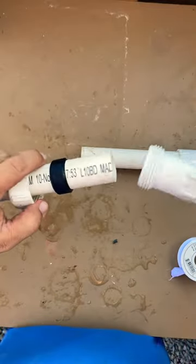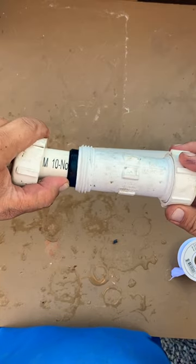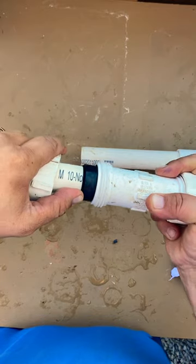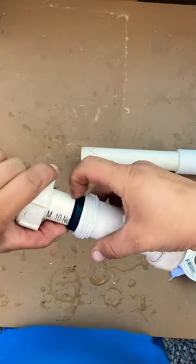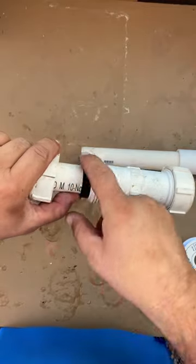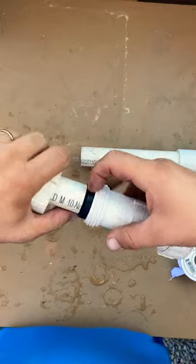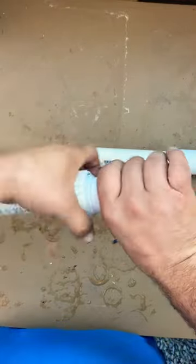This is just an example — I'm not actually attaching to the pipe. You can see how it slides down in there. If it's on a bind and won't force in, it's going to leak no matter how much you tighten it. You'll have to force it into place by putting water on it and pushing around on the seal until it seats the bead all the way in.